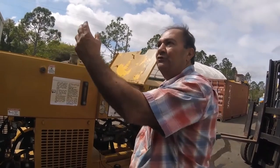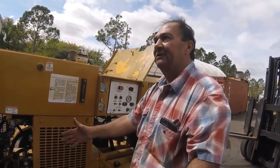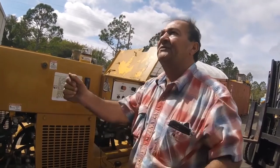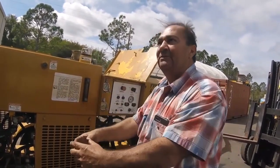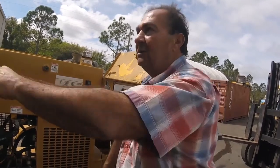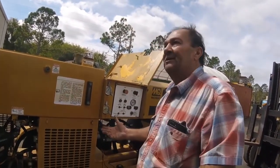That's where I start to use the water. If I want to clean the hopper into my basin, okay, then I take the water hose in there and I inject it. It gives me a little bit of water, then I cycle. Okay, and I'm noticing that I'm getting gravel and fines and sand out, which I'm getting cleaner. Then what I do at the end, I'm still in reverse, I take my thing and I'm pulling out. Okay, and then I'm pretty clean.